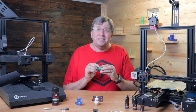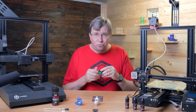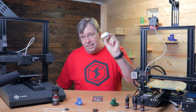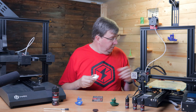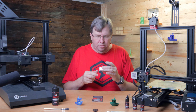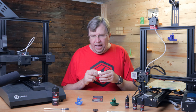I put this polymer onto a glass plate and onto a BuildTak-style surface from the TronXY, and I'm glad to say the results are impeccable. As you can see in front of me, I've got some Benchies printed in ABS without any brim, no warping, no peeling - a perfect print. I actually tried the acetone vapor smoothing tester and took a closer picture of it.